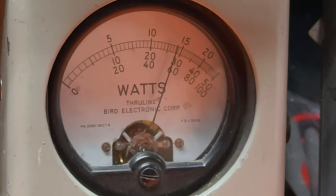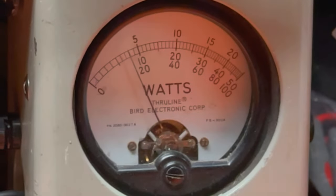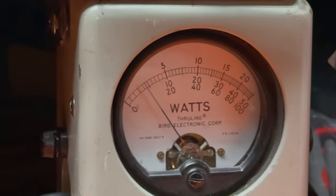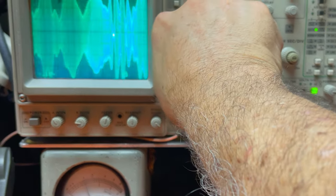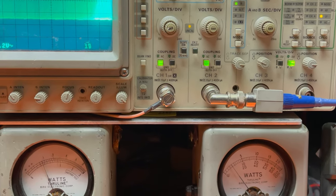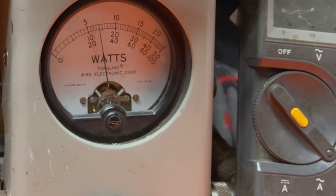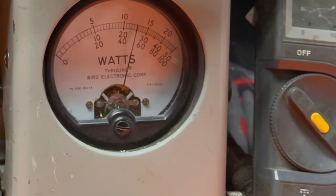Audio check, audio. Look at that, about 56, 57 watts there. That's AM. And then if I turn the power all the way down, audio. Look at that swing, just goes down to nothing. So 1 watt, audio, barely swings. No overmod going on here. Audio, check. Audio, 1, 2, 3, 4. Audio, and as I bring the power up, you can see on the peak power there, it's going to come up with it. Audio, check.